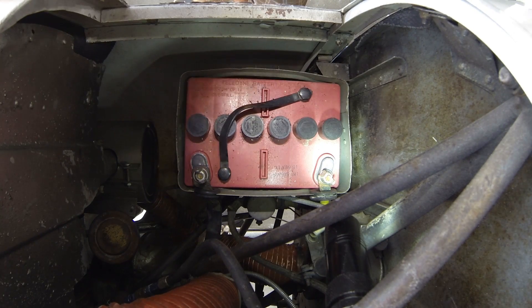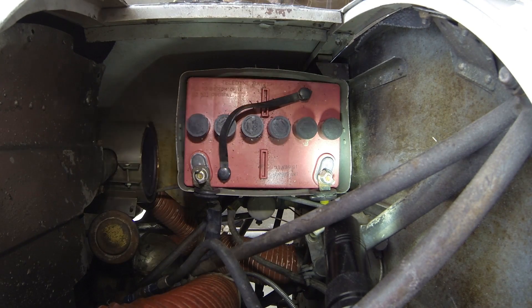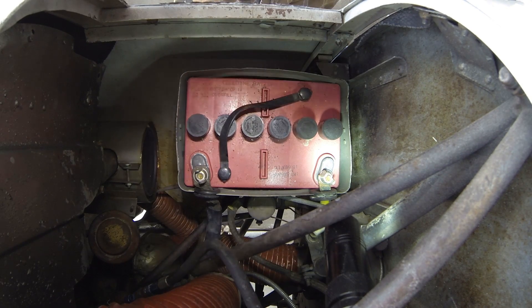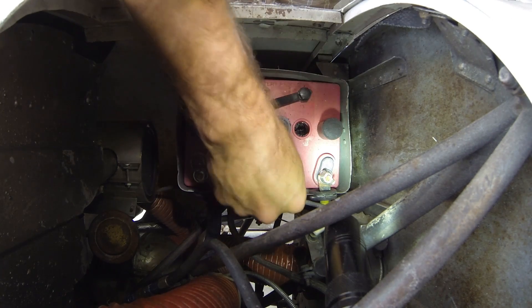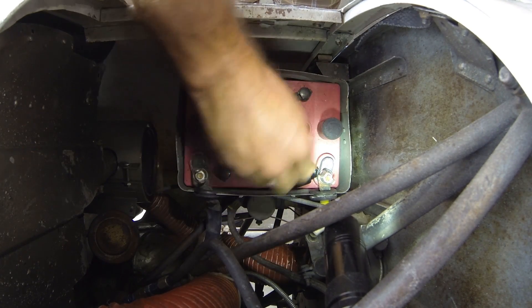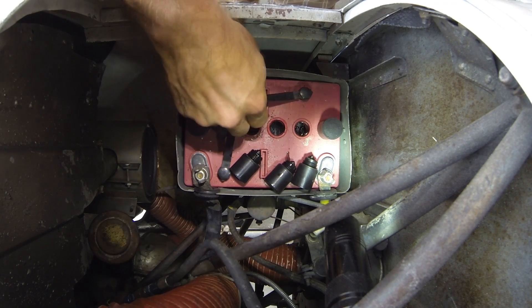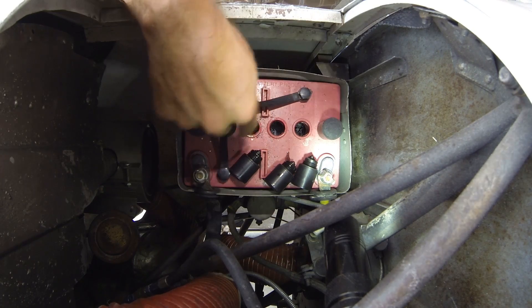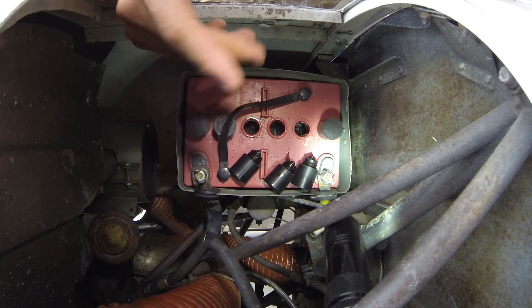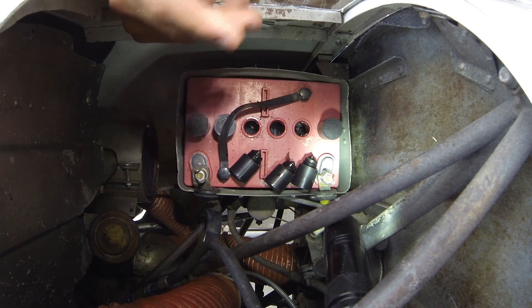You can see this battery was replaced on the 15th of September 2012, so four years — that's about the life of that battery. It's actually pretty good for a Gill battery; they tend to only last about two to three years in my experience. You can see there are six little caps you can unscrew, and there's some electrolyte in there. You want to top that off from time to time — usually when your plane goes in for annual, a hundred-hour, or even sometimes 50-hour inspections. They'll top off that fluid just below the rim. Keeping the battery topped off with electrolyte keeps it from overheating. If it runs out of electrolyte, it can't produce power or keep a charge — it basically stops being a battery.